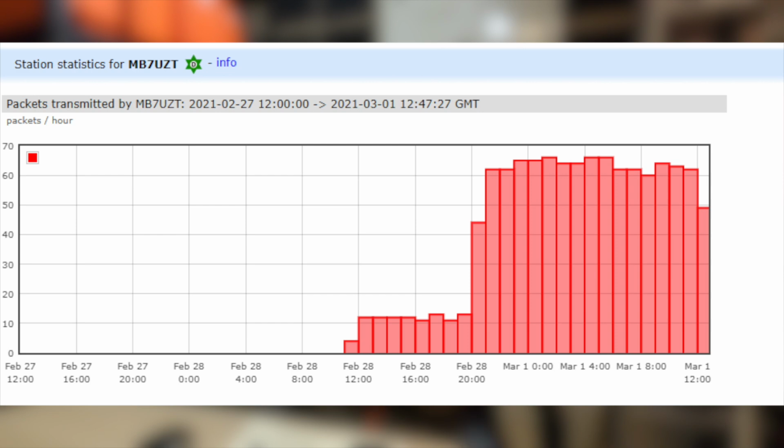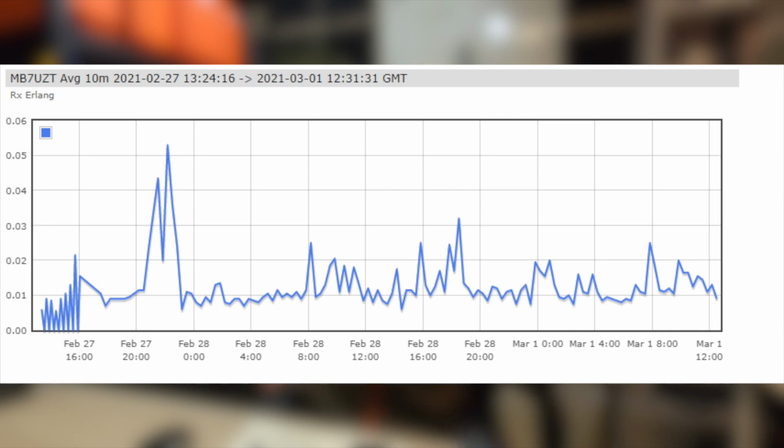But also going to APRS.fi, going to the main APRS site, I can actually have a look at the telemetry from the repeater, so I get an idea of what I'm receiving, what I'm transmitting, what I'm iGating, and I can tweak the settings in Direwolf to make sure that I'm not flooding the system, and that I'm also actually doing some useful repeating and iGating in the local area. So that's what I tend to do. I tend to run from the command line. I run the logs as well as looking at the main website. So between all of that, it gives me a good view on the whole system and how it's running.